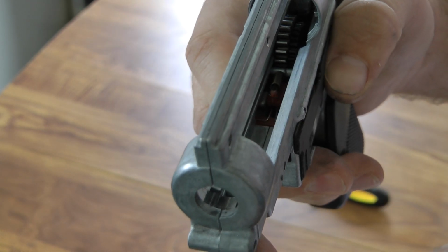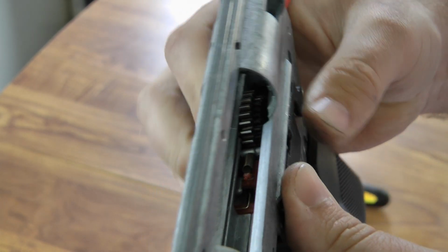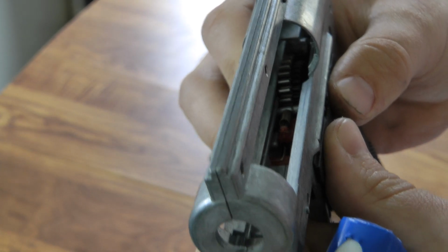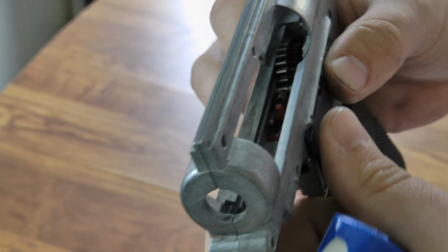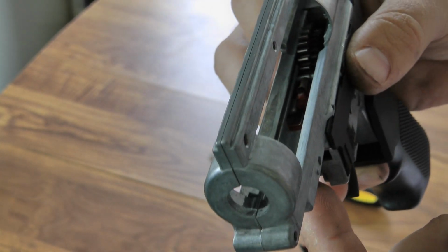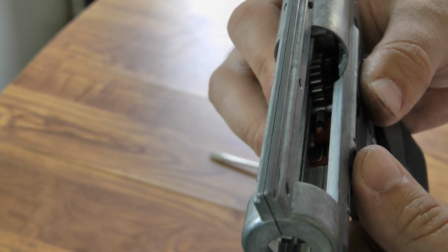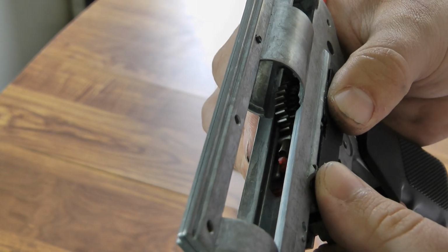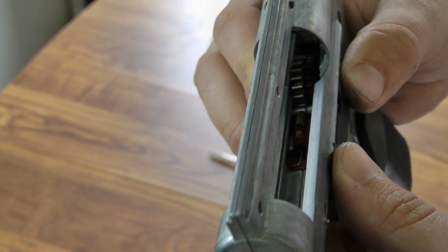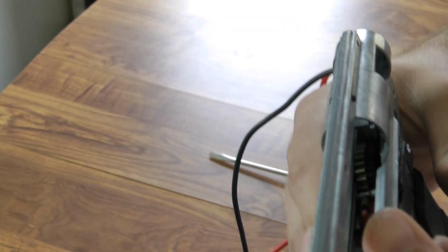So it's a really good visual cue here for testing. Plus it helps gun techs. Sometimes they read on paper, if you know what I mean, and they say that they understand how the cut-off lever operates, but now you can actually see it happening and feel it happen as well. See how it disconnects there, and you just get a single cycle.